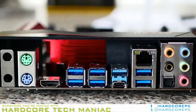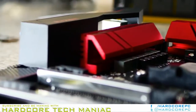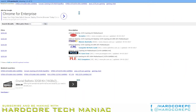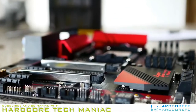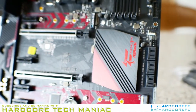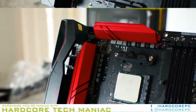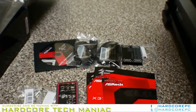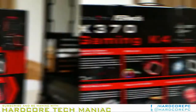Water pumps are limited to a maximum of 1.5A. The VRM heat sinks appear similar in size to those of the ASRock X370 Taichi, but lack the angles and style in favor of simplicity. With the extra storage, M.2, and Wi-Fi M.2, there are only 2 PCIe x16 and 4 PCIe x1 slots available. The lack of additional x16 or x8 slots limits higher-end card options, though if you need more I/O, you likely wouldn't be considering a board with features aimed at gaming enthusiasts.